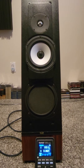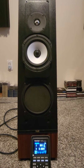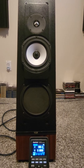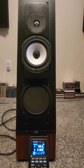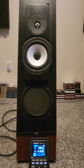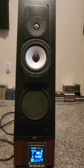With what you are driving these with, it should be fine even if you use a stereo receiver, until you don't crank it up. But if you really want to get the best out of them, I suggest you connect something that has massive power reserves, because your amplifier should be able to drive large amounts of current to make any sound from these rather inefficient speakers. These are only 84dB and they only measure between three to four ohms.